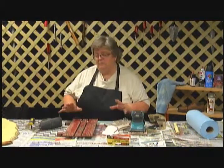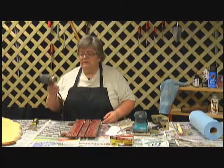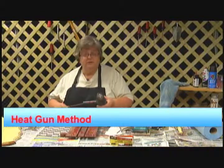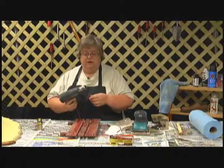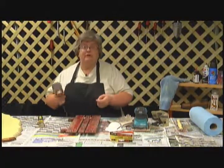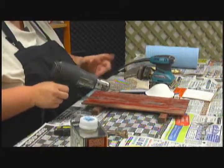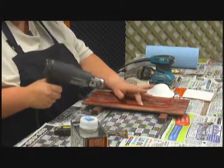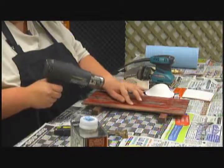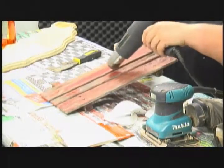The next method is using a heat gun. This is a heat gun you can buy at any hardware store. Some of them come with a little scraper attached, but you usually lose them, so you have to use your separate scraper tool as well. Be very careful around the heat gun because it gets extremely hot, and you can burn your hands or legs depending upon where you set it down, or catch something on fire. What the heat gun does is basically melt and separate the paint from the wood. We're going to turn it on here and heat up this area.